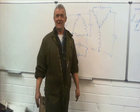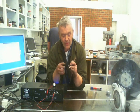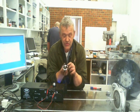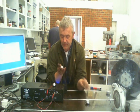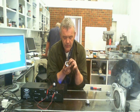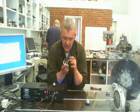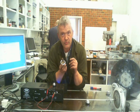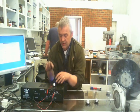Here we are with a couple of the motors — they're both Y configurations. If you look at the back of them, what you'll see is three pins, and those are the pins you basically solder three wires to. Some of them have four contacts — it's still the Y configuration, but the fourth contact is the common contact, the one that you don't want. To find that common contact, all you do is use an ohmmeter and find the one with the lowest resistance — that'll be the common. Then use the other three.